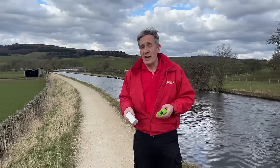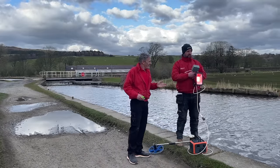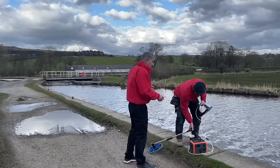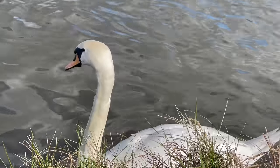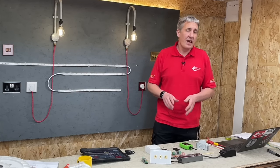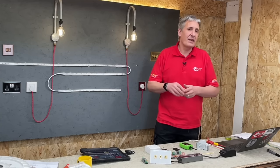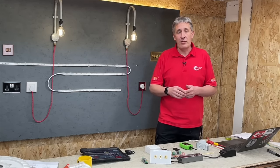Let's cut back to the workshop and take a closer look at the system. Rick, we've easily proved that was 200 meters! RF Solutions produce lots of different types of wireless control systems - a lot of them are pre-packaged with enclosures and suitable glands to achieve an IP rating - but the one we've used is the Ferret, which is a small PCB module. The advantage of that is you can sneak it in - as the name suggests, ferret it - into equipment that could benefit from wireless control.